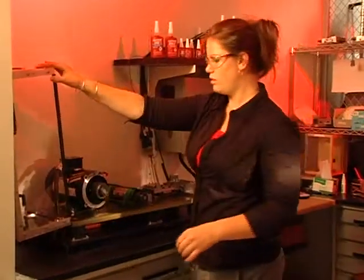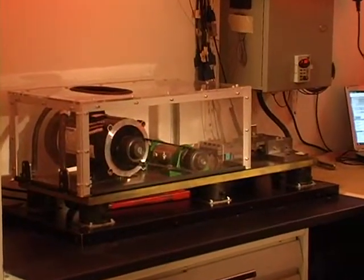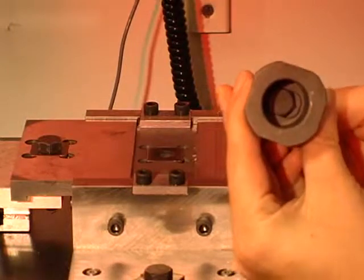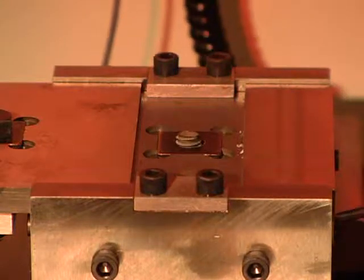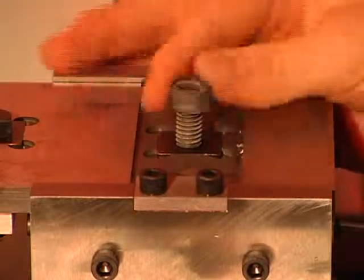To demonstrate how different fastening devices hold up to vibration, a simple test can be run. First, the technician will test the properties of a plain nut and bolt assembly with no mechanical or chemical locking device. To begin, the laboratory uses a 3/8" phosphate bolt and nut and a hardened steel lubricity washer. The motor speed is set. The bolt is then slipped through the load cell and the nut is spun down to the surface of the lubricity washer.